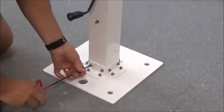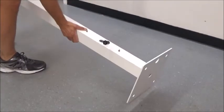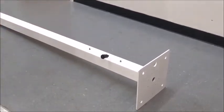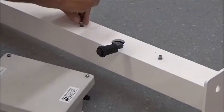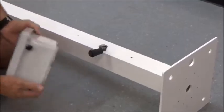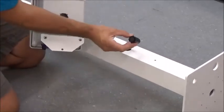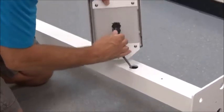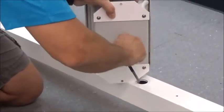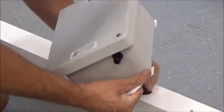You should be able to lay the whole mast and base down on its side — that will make it easier to attach the junction box. Remove the screws and set those aside. You'll take the connector; there's a little tab inside but it only fits in one way. Line up the tab, press it in firmly, and it will rotate 90 degrees and you'll feel a detent snap into place.